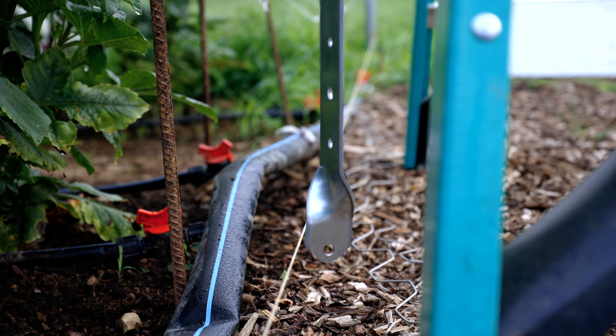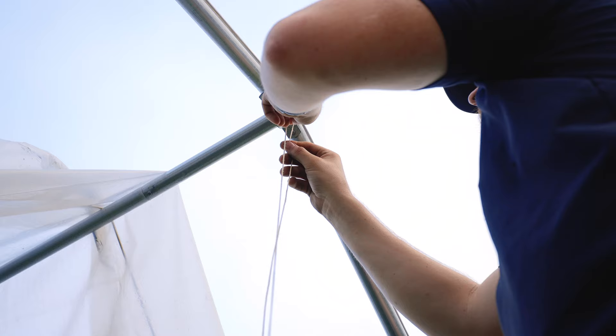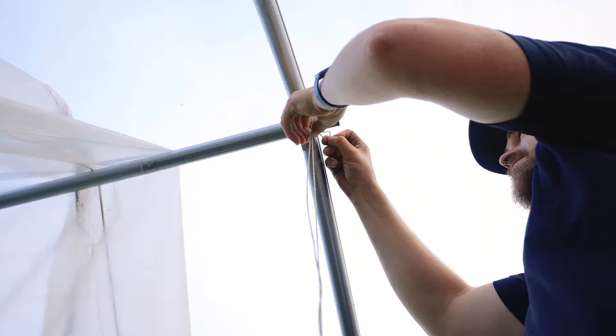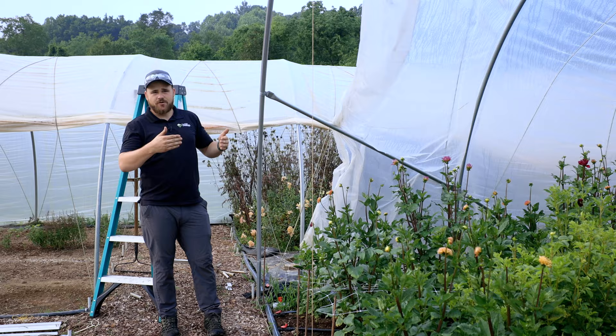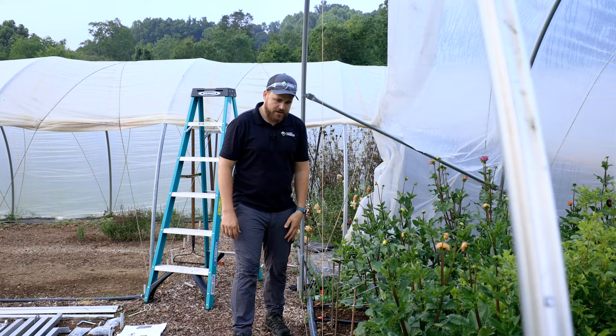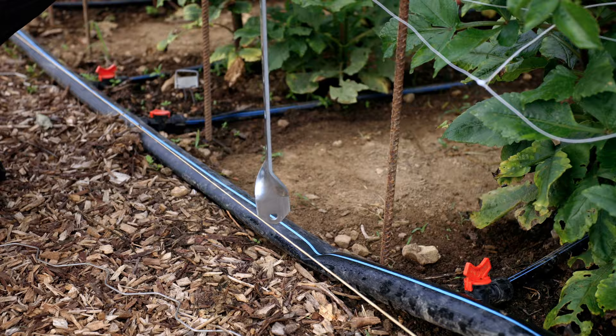You want the string to be right up against the face of the bow, and the metal bracket at the bottom should be just above the string you've already stretched across between the bows. This step is one of the most important because if your bow is not perfectly plumb the door will not function properly — it'll tend to swing open, swing closed, or just have issues being square. The goal is to get the plumb bob to hang directly above the string.